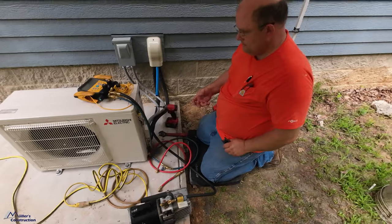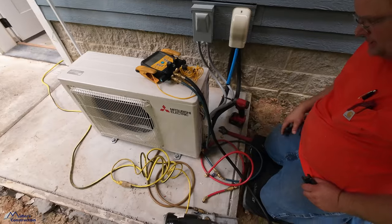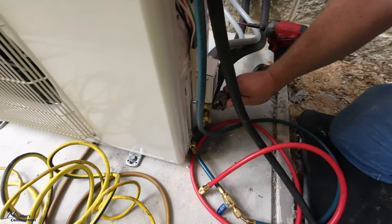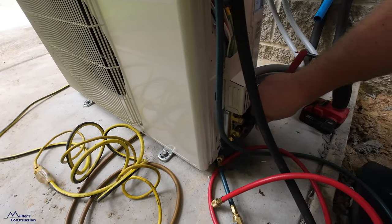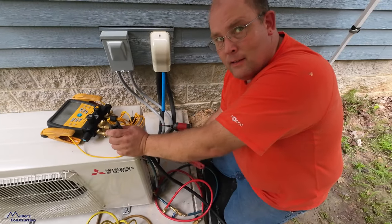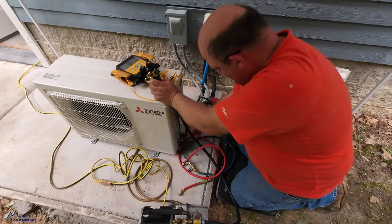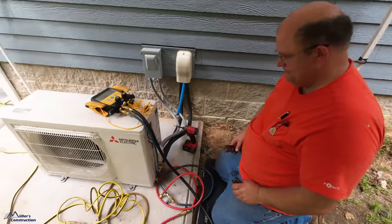Because what I don't want to do is put too much refrigerant into my hoses and lose it from the system. These are called thumb screws. Yeah, but you never want to just make them thumb tight. You want to lock them down good, because if those seals fail, there's just an O-ring in these, and those aren't tight, you'll lose all your freon. And then this one, you want it snug too. If that Schrader valve ever fails, you've got a backup. Right. Gotcha.